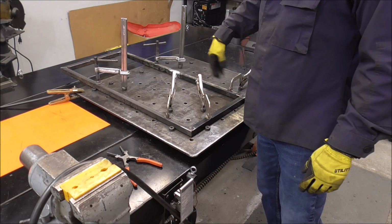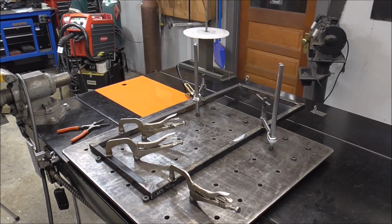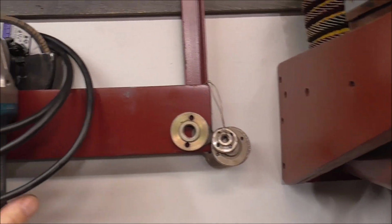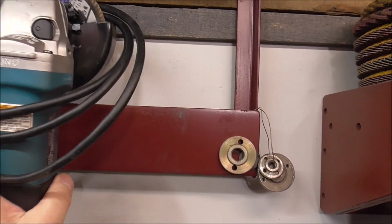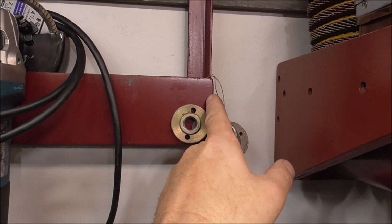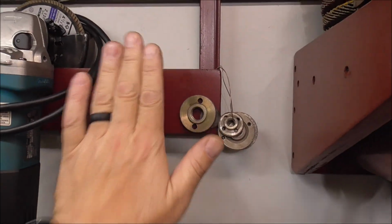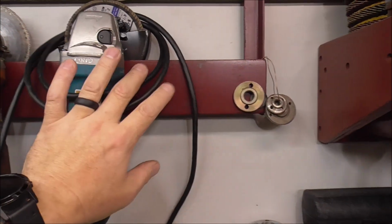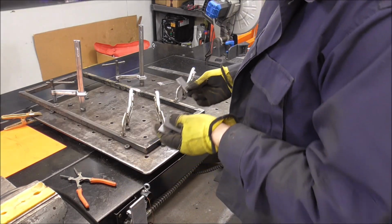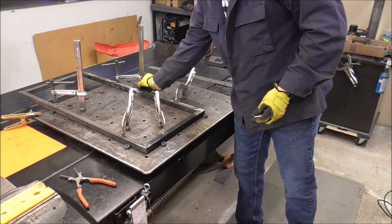Now we've got to put some straps across it so we can hang our grinders off it. The tubing that we're building this out of is 1x1, and this angle iron is also 1x1. So when I put this strap across, the one issue I've been having is that it's kind of tight when the grinder goes in and out of this. So what I'm going to do is come out with a piece of 2-inch flat bar, and then put the strap across. So it's going to set it out a little bit further. It'll make putting this away a little bit easier as well. I just cut up 3 tabs that are 1 inch long, and we're just going to weld one on this side like this, one on the other side, and then another one in the middle for support.